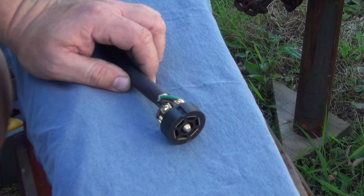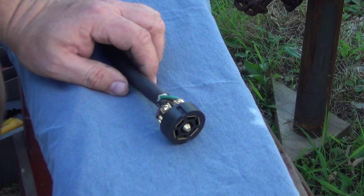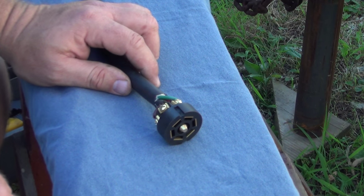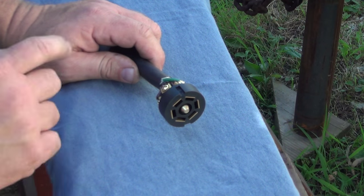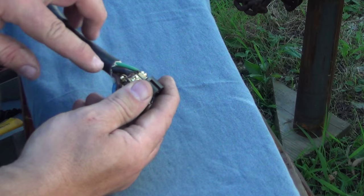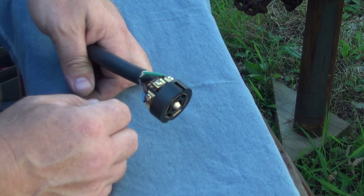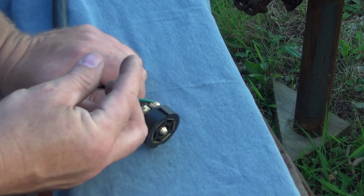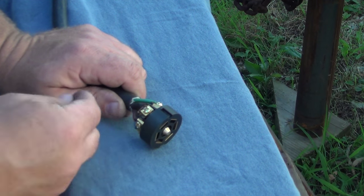All right, I'm back and it's much later in the day — the sun was going down when I started and I'm in the shade now. You're going to be glad you watched this video because I'm going to tell you what to be aware of with this connector. Whenever you do the center wire — the yellow wire — the screw that goes into it will actually spread the wire and not make a good connection. What I did was run solder on the wire to create a solid end, so when I ran the screw in it didn't spread because the solder was holding it.